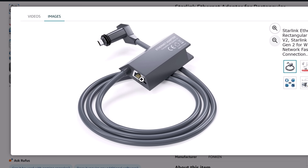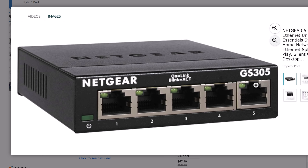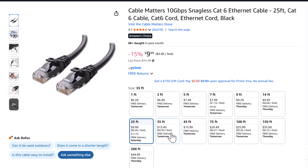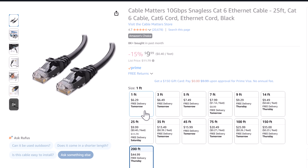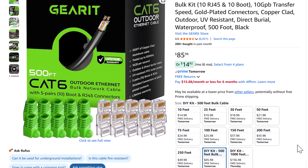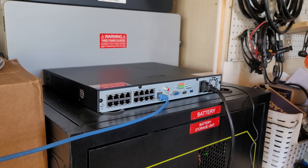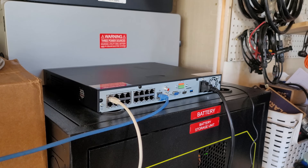All you do is connect an ethernet cable to the adapter and run it directly to the main central hub. If you need to run more ethernet cables — like I do for Bitcoin or crypto mining — you'll want a Netgear switch, which gives you a hub to distribute all the ethernet from. You can buy pre-cut cables already terminated at whatever length you need, and it's really not that expensive. Or you can buy outdoor-rated and burial-rated waterproof cable for less than a hundred dollars — this 500-foot roll even includes the terminations and crimp tool. The cameras do audio, video, and power through a single ethernet cable, which makes life so much easier.